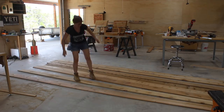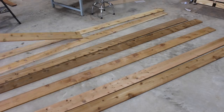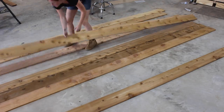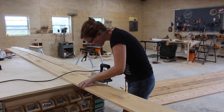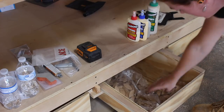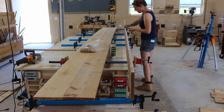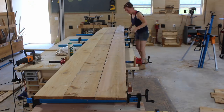The end result might look heavy but it isn't too bad. To keep the weight down I went with cedar for the center slab. The gate will be 14 feet across, so I started off with 16-foot boards and began by laying them out on my shop floor to arrange the grain pattern. I wanted the gate to end up around five feet tall, so I bought eight one-by-sevens and started gluing them together one board at a time. This process took four days total as I could only glue up about two boards a day. I used my Triton biscuit joiner to cut a slot every foot or so, then used Titebond III wood glue as it's waterproof — and of course this will be exposed to the elements.